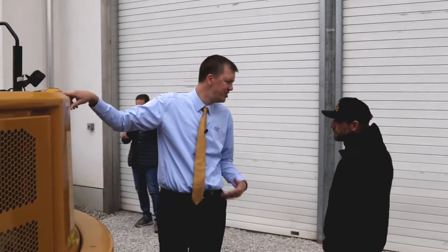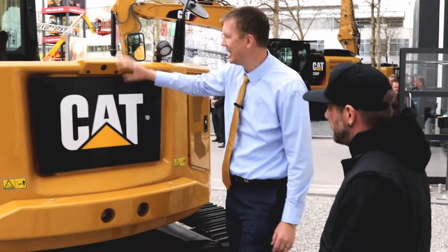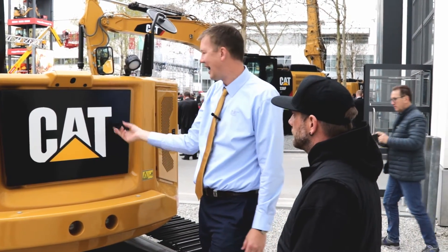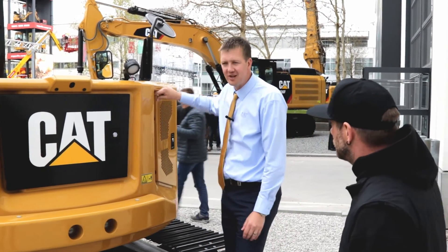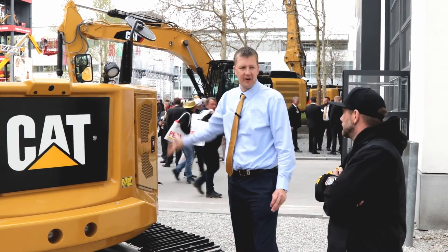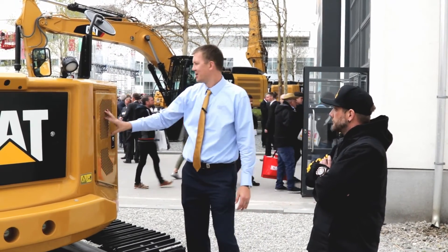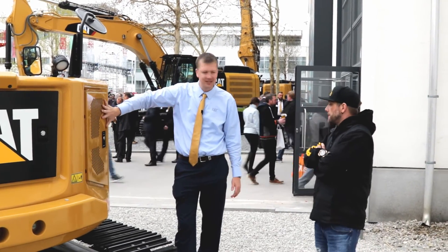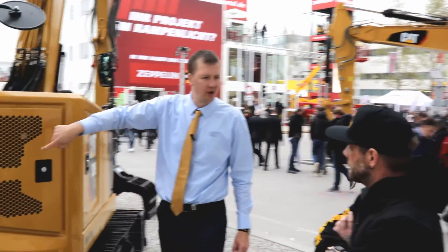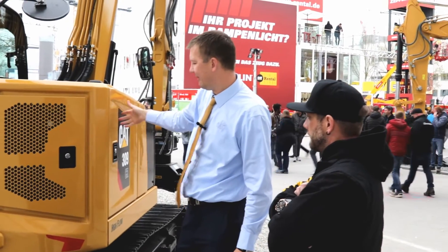When we're designing it, we said you need cameras now, and this one's just integrated into the counterweight — so if you need to get to it, you pop it off and do what you need to do. Just the attention to detail to integrate that in. On previous models, there was a big door over here that was quite costly if you bashed it in. Now we've got these flat panels — if you hit something, hopefully you'll hit the counterweight; the panels are protected and sunk in. From a 307.5 all the way to a 310, these panels are all the same size and cost a fraction of what the previous parts did.